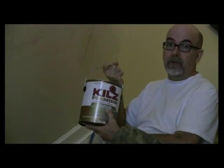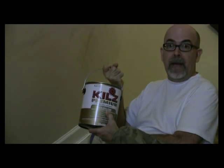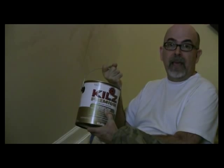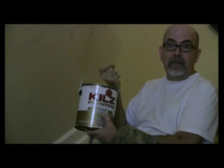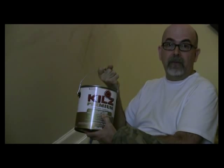We're going to try this with one coat first, put it on nice and smoothly. The second thing is we'll come back and do a test at 24 hours. Kilz does say you can apply top coats two hours after, but I'm going to do one coat first, see if it leaks through, and if it passes the test and does not leak through, then we'll go ahead and finish out the paint.